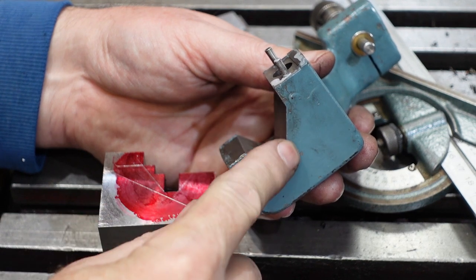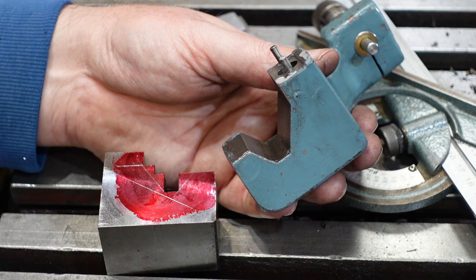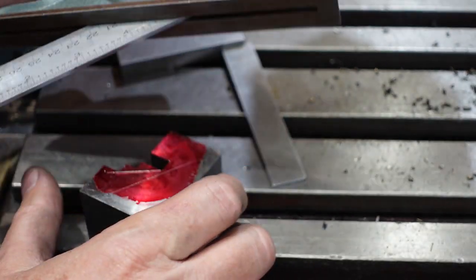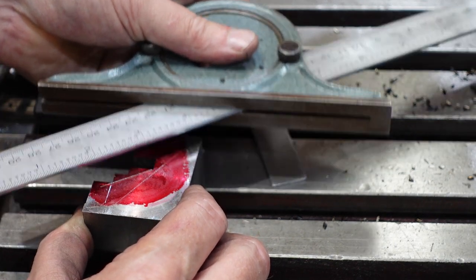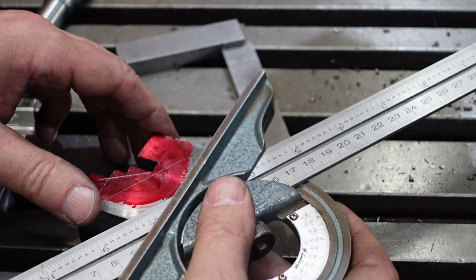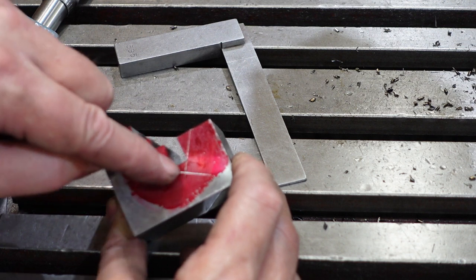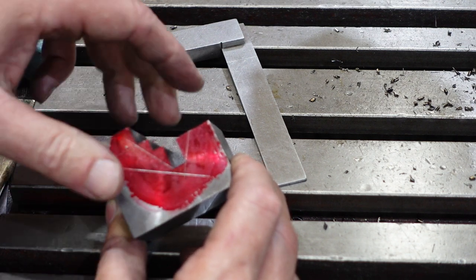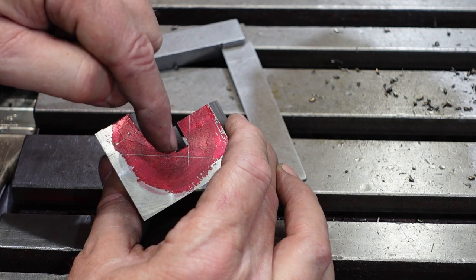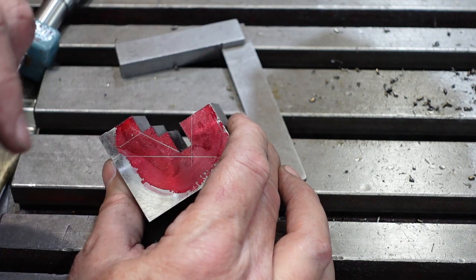This angle in here seems to be 65 degrees. I say 'seems to' because I've measured a number of times and that's what I get most times, but every so often something throws up which I think can't be right. I marked off 32 and a half degrees on the protractor here, and then I've put a line from the bottom of my slot and over from the other side, then went around a 90 degree corner and put another line - so that line and that line are 90 degrees. So the first step is to line this up in my vice, come along with a cutter and take that piece off to get a bit more clearance. I'm still going to have a slight undercut though, so I have a plan.